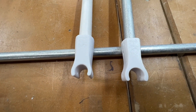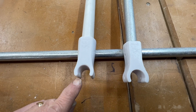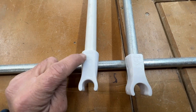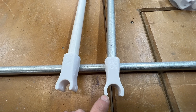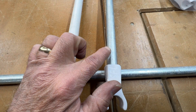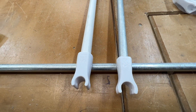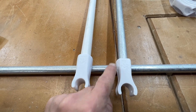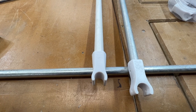Here are the two SFL fittings I'm going to use to make my snowflake mounts. The one here is a half inch EMT clip — it clips right onto the EMT pipe — and then we have a half inch PVC coupling. The next one is a half inch PVC clip going to a half inch EMT coupling. He also has a half inch PVC clip to a half inch PVC on the other side, and EMT to EMT as well, to get those 90 degree connectors.